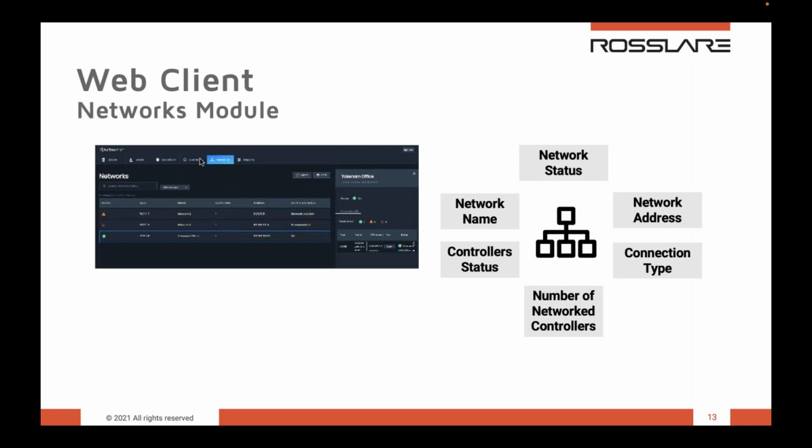The next step is the network module. Here is where you can administrate the IP addresses. So you can add panels, administrate panels, or a network of panels. I believe you use this tab just one time, when you configure the system, and when you need to make some maintenance. So this is the network module. You have an additional task here: if you need to control your access control from a remote location, you have to configure the firewall in the router, also indicating the port forwarding, etc.